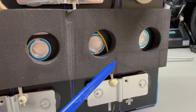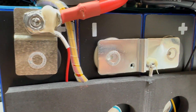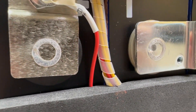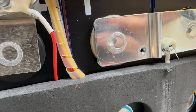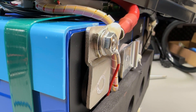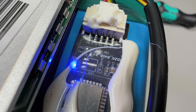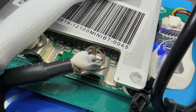On the electrical connection side, it looks really nice. I can see the voltage sensing wires for individual cells, then heavy solid jumper links for the high-current connections. They're neither soldered nor screwed — it looks like welding, but a type I haven't seen before. It looks perfect and high quality. I wonder if it's ultrasonic welding — let me know in the comments if you know more about this welding technique.